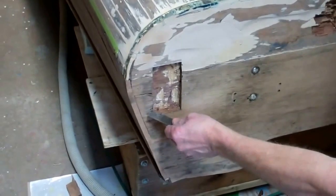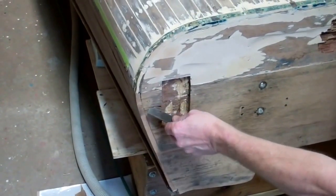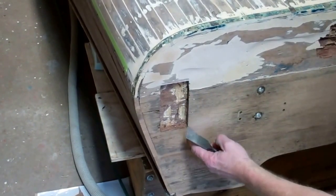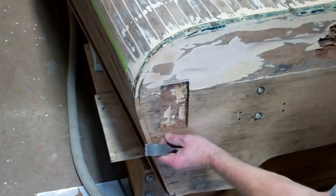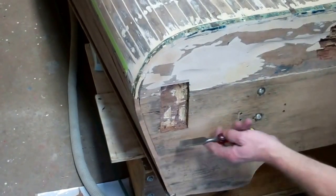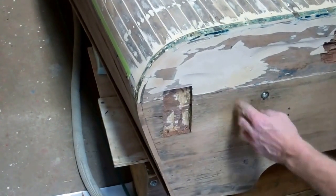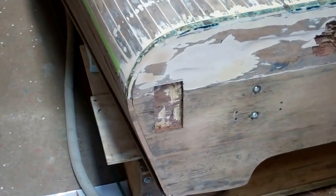What we've discovered — you can point it out, John — it's all rotten, right in here. So we're going to take this Dutchman patch and bring it right from where they put it all the way out to the outside edge and get rid of a little more of the rot that's there. At least most of that is above the waterline, so it will be finished bright, and we'll take care to do a really good job.